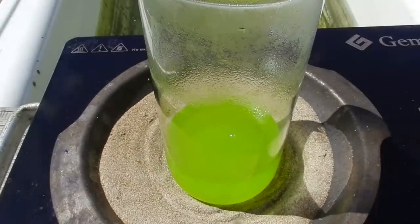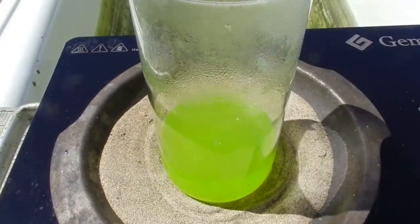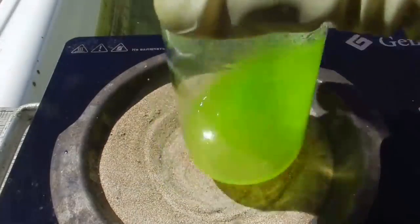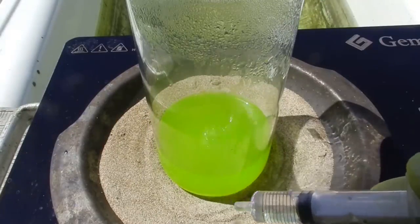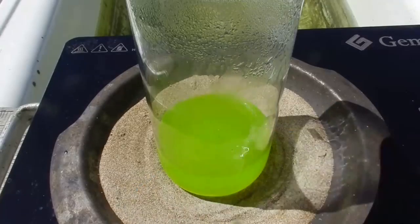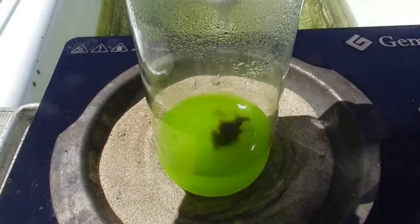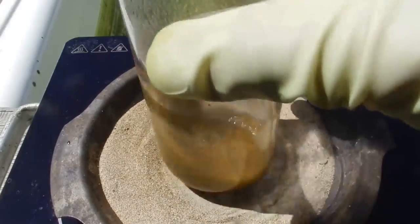The solution boiled and its colour became more yellow, but still the solution is dirty and cloudy because there are always some base metals as impurities. I add 2 grams of sodium acetate to bind the acids. There didn't seem to be any sediment. Let's do the first deposition and see what we get. If a large residue falls out, simply boil in nitric acid. I will use hydrazine hydrochloride to restore. I add it drop by drop. Let's see what beauty we will have now.